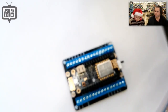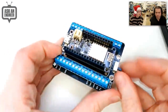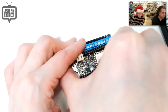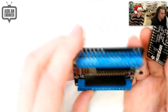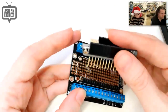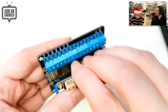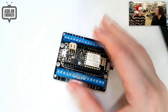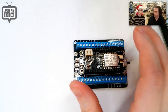Let me show it quickly on the overhead. So yes, this comes exactly like this. There's an on/off switch which turns on and off the enable pin. You just take whatever Feather you have and pop it right into the headers. Then you can use the terminal blocks to connect up wires, sensors, NeoPixels, or whatever. It just makes it really easy to build your project and put it into your kit. We already had this in the store — it's just now it comes fully assembled.